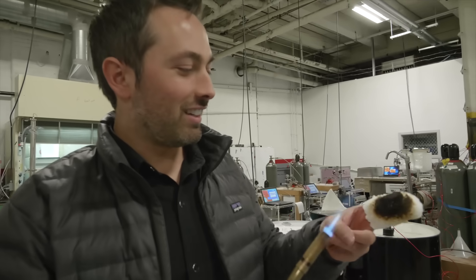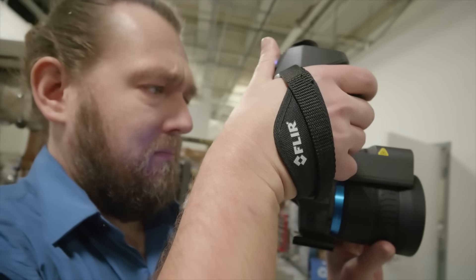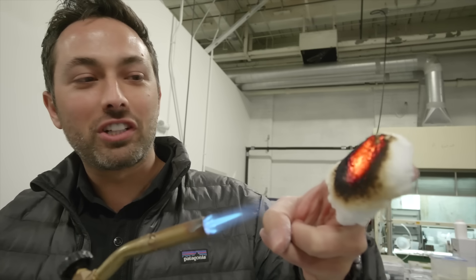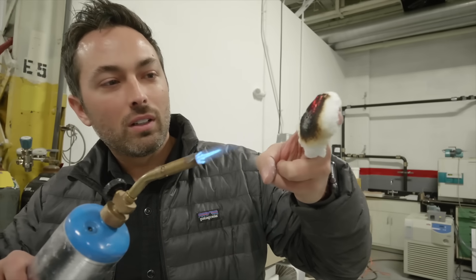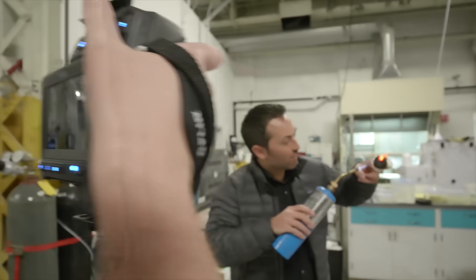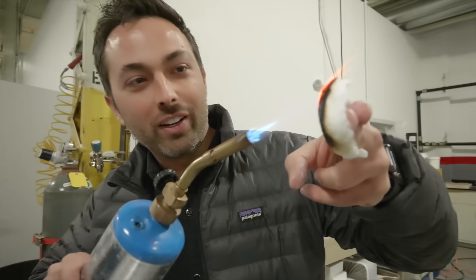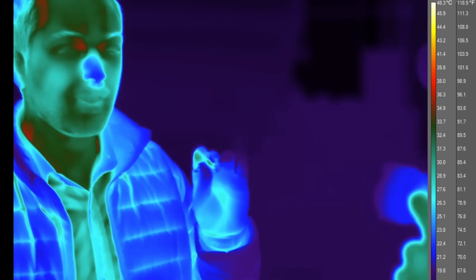What's the non-flammable binder? Proprietary. I cannot believe how little warmth I feel passing through that. The FLIR 1020 thermal camera has different temperature ranges, and here the aerogel is clearly hotter than the 160-degree Celsius upper limit — it's glowing orange hot. So we went to the highest temperature range, which goes up to 2,000 Celsius. 907 degrees Celsius. That is absurd — right in front of my fingers. It was about almost 1,000 Celsius, but behind this thin layer of aerogel, my fingers are just warm. It's at 31 degrees.